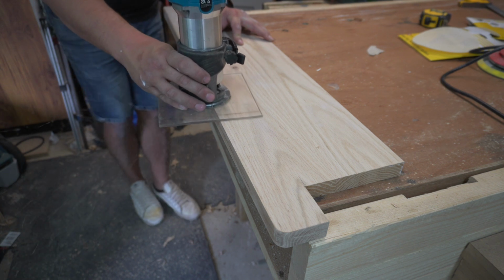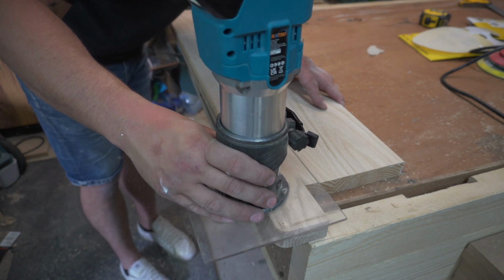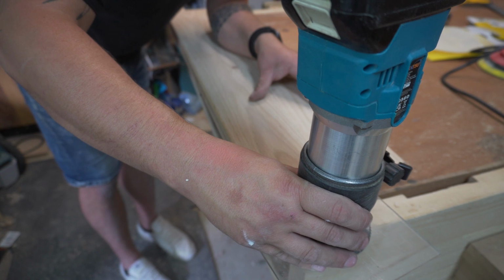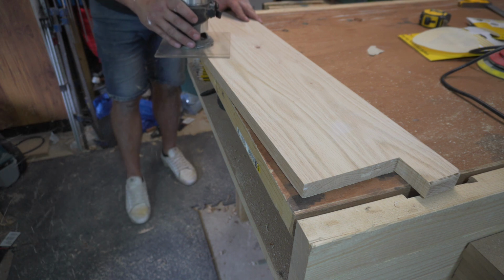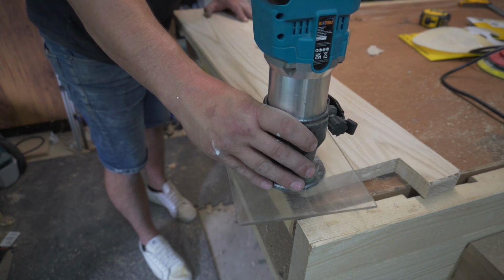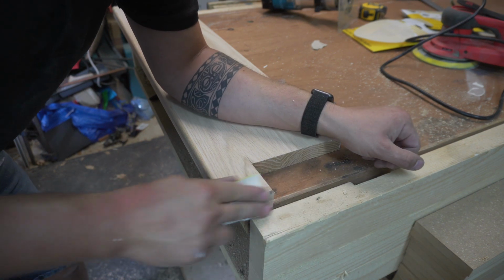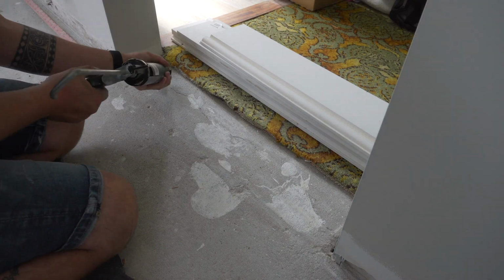And then yet again, just putting a round over on them edges. I don't normally like pencil rounds on stuff. I prefer a chamfer, but like I said, if you're walking around barefoot, which we normally do quite a bit, you just don't want to leave sharp edges, so pencil round on everything here. Sand them edges up by hand. Router cutter, funny enough, that is a brand new Trend router cutter in there, but it was burning a bit, but we are in end grain on oak.